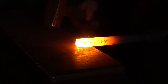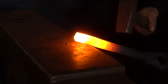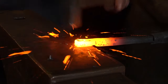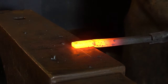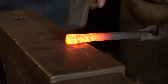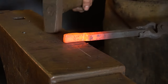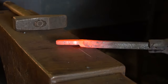Out to my first mark on my anvil. Drop it down to 45, aiming for that corner of the anvil. Don't come in too deep — I'm deep enough there. What I'm going to do now is hit the same place, lift that up, and I've got plenty of heat left in my nib, so I'm just going to bring it back slightly and then forge that out. I'm not going to forge that back down to 16mm, but just refine it a little bit and leave it oversized, because later on we're going to come back and touch up the nibs and tidy that all up. So that's the first nib on the first tong done. I'll stick that back in the fire and do the second one. You don't want to go too thin, and you don't want them too wide either — these are only for flat-bit tongs.